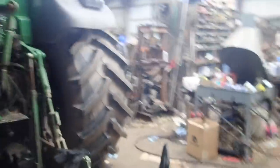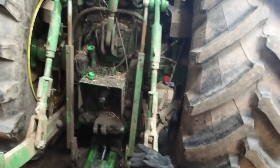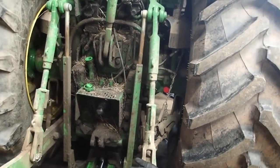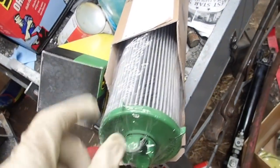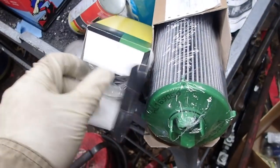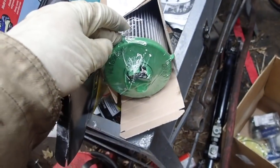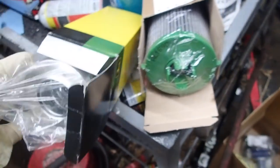we're working on this tractor. It's a 7530. It actually is warm in here now. This tractor needs a bath, but I just haven't gotten around to it because I'm not going to go out and freeze my ass off. But what we're doing is we are changing the oil in this thing. It takes a specific type of filter. There are two — they're high-pressure filters, under some pretty severe pressure. This one has an aluminum housing. This one is for the hydraulic and this one is actually the transmission filter.